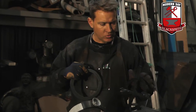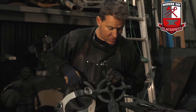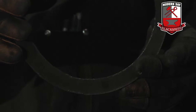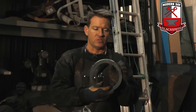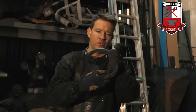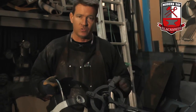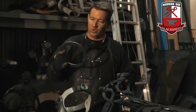The ring on the candle holder itself, I hammered it on the anvil for the actual finish. When you cut it, you're going to have some imperfections — parts where it might have come off — so just take a hard wheel and a grinder and clean it up a little bit. Some spots where your plasma torch might have jumped and cut into it, just put a small weld on there, grind it back. It's a medieval type candle holder, so it doesn't have to look laser cut. It's old world, so the rougher the better.